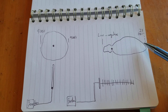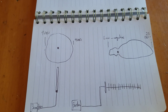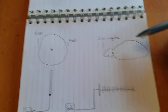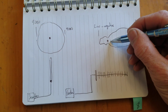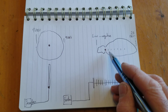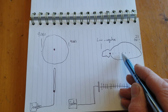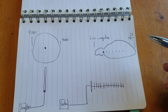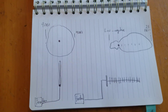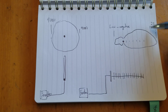If you don't know what dB is — every 3 dB basically doubles your signal power. So at 3, 6, 9, 12, 15, 18 dB and so on, each step doubles the power. It's not just increasing it by a small factor — it's an exponential increase. So when you're pointing the Yagi at a cell tower, you're getting this massive increase in gain.